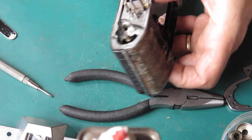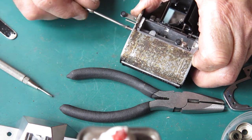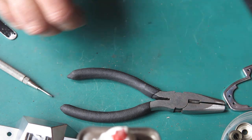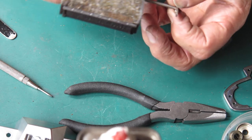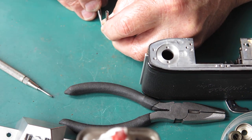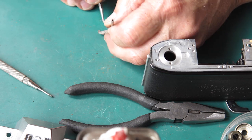I'll remove the screw from the top of the release shaft. Recover the screw — the screw goes in the wash. The spring goes with the springs. We'll lift this shaft out the bottom of the camera and lift off its spring at the base, because otherwise it'll only end up getting lost or damaged in the cleaning.